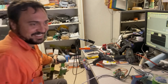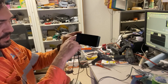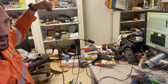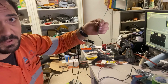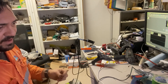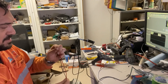I make it pretty tight around my waist because it holds my back together and makes it strong. I want to get the power wires out of this side of the box and all the motor wires out of the other side — so it's only going to take three wires. I'm using pretty thick wire, which is overkill, but when you're rolling around on the floor of the boat and snagging on stuff, the thin wires break. These ones are pretty strong — about three mil.